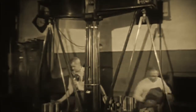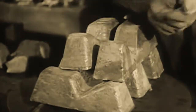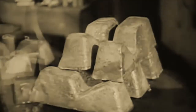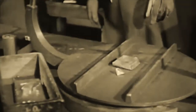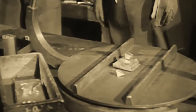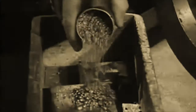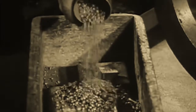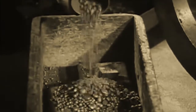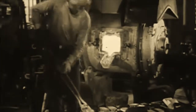The metal content and fineness of coins is fixed by law. Here, metal is being weighed out for the making of pennies. A single penny weighs 48 grains and contains 95% copper alloyed with 5% tin and zinc. Carefully weighed out in small units, the alloys are placed in a separate box to be put in the melting crucible along with the pigs of pure copper. Each step is supervised by trained men, whose accurate work has built up over the years the unshakable confidence of the people in the money of their government.